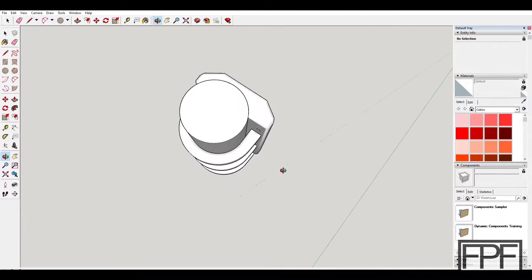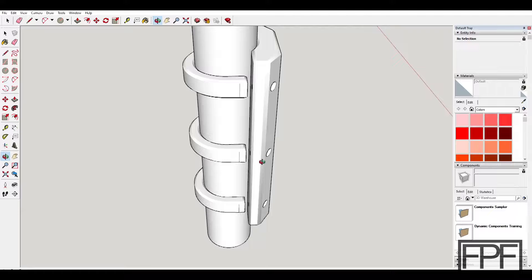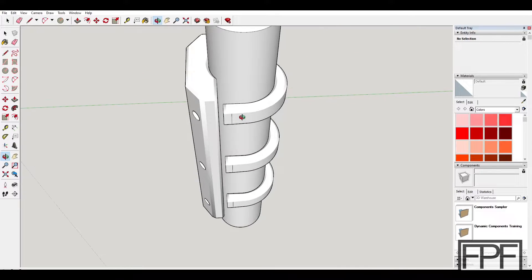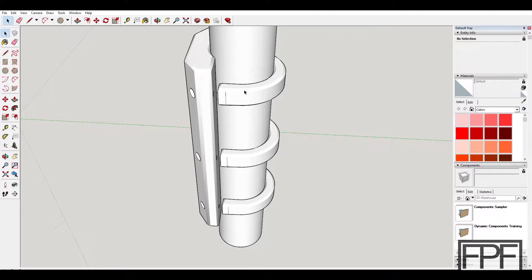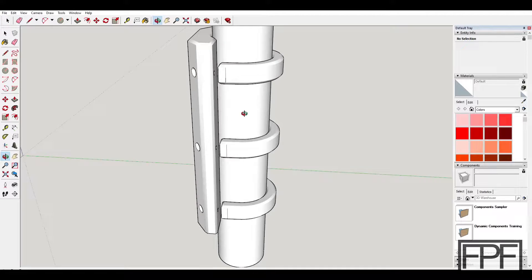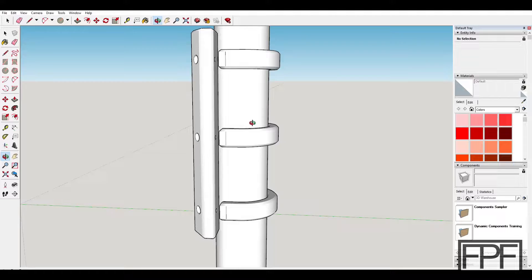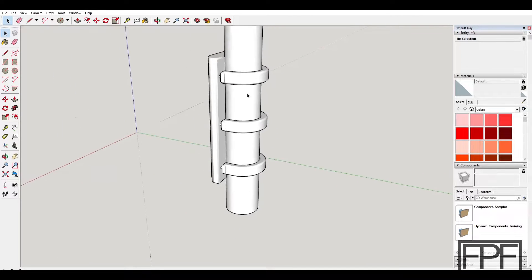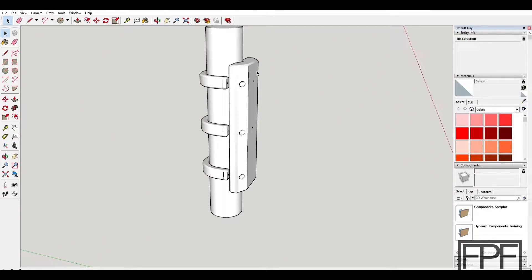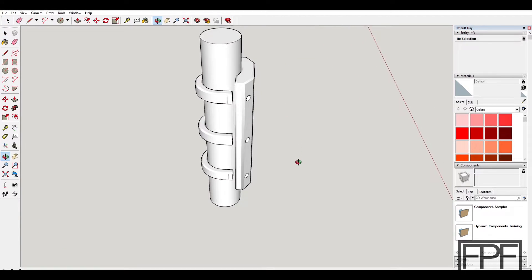It's the first time I've tried clamping around a pipe, so I'm interested to see how this goes. I'm not sure how much gap to leave — I've left four millimeters on each side. That's intentional, to give these guys a bit of flex to pull in before I get to this face. These shouldn't tighten all the way in, but they shouldn't be all the way out either. Ideally some of this gap will close up, maybe down to about two or three millimeters, and this should be nice and snug on the pole. Three straps might be overkill — I originally had just two and added a third in the center to make sure I get enough friction to keep it from sliding down the pole. The extinguisher weighs maybe about two and a half pounds, but that two and a half pounds is going to tug pretty hard when you're going over a bump. Let's get this stuff printed.